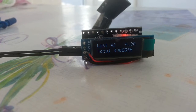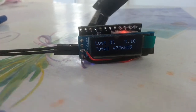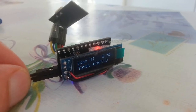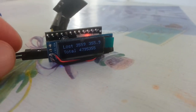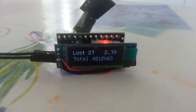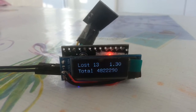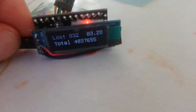I moved to another room and I can still receive the signal with some significant loss. If I move the antenna a bit I can lose the signal completely. It works, but it's not as good as I was expecting — I'm getting 100% loss at times. If you position the antenna the right way you might still receive the signal, but you need to be in direct line of sight, or build an external antenna, or use a different model with more power. For this module the application is very limited.